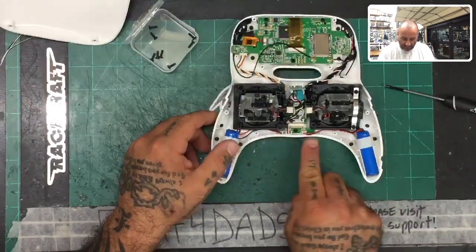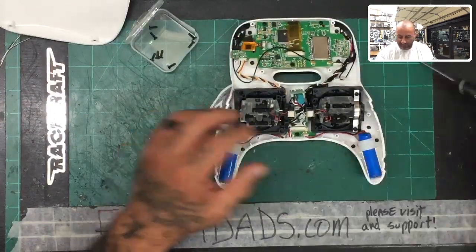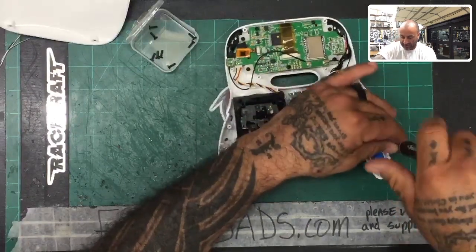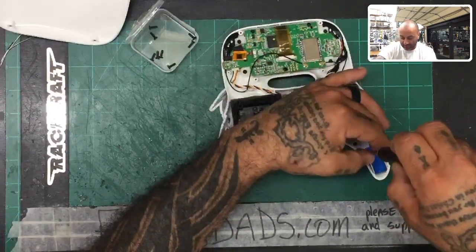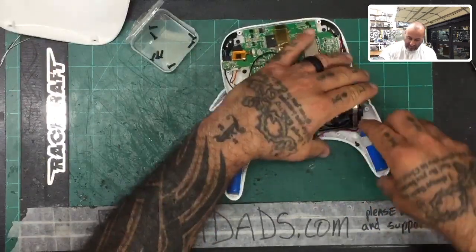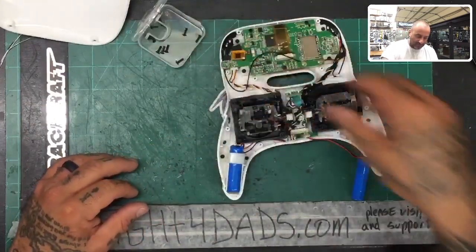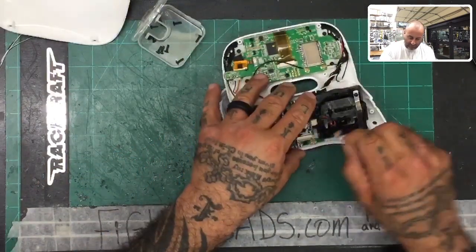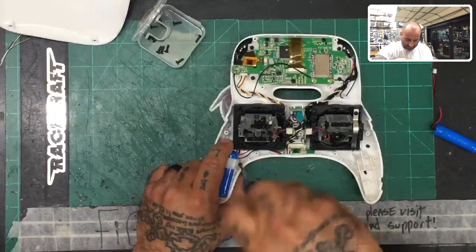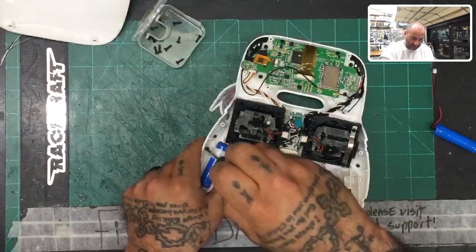It's pretty clear here that you've got your batteries, and this is what is failing on the transmitters right now. The batteries are actually coming in dead, and they're not recharging. That's the biggest problem. So I'm gonna pull these out. Let me take these two screws out. You can keep the harness and all that, just throw those in there, but those screws won't be used. And then, there you go, just pop that one out right there. And then let's take this one out. And then this one here.